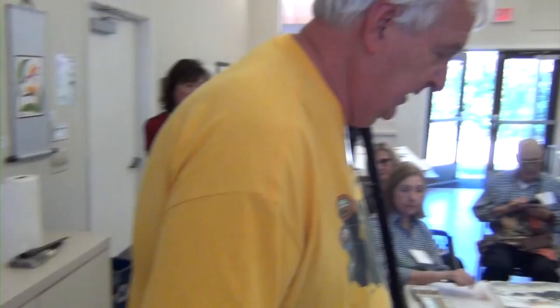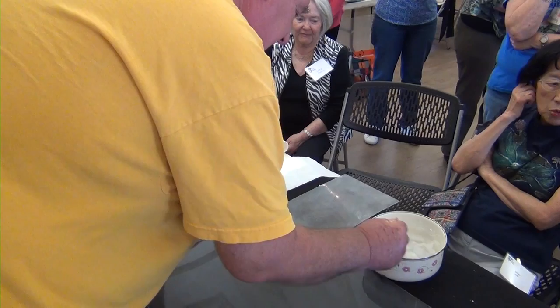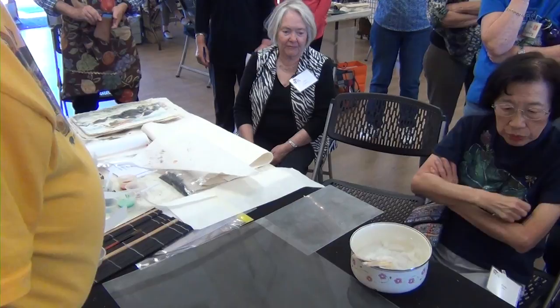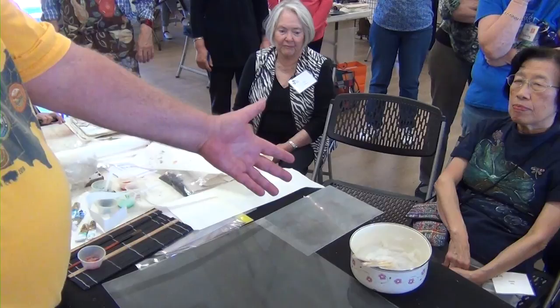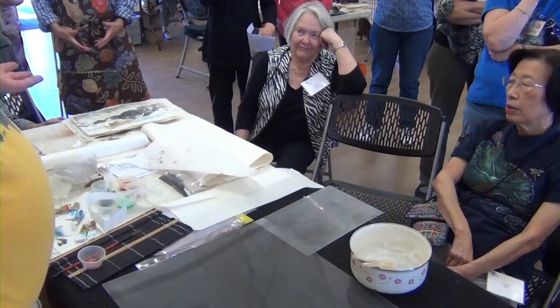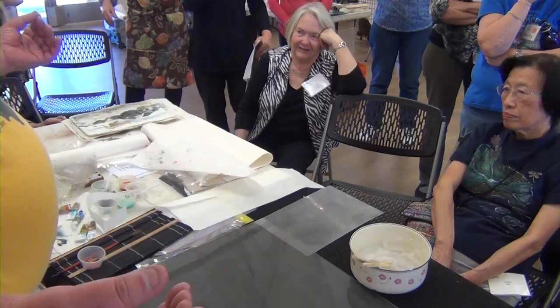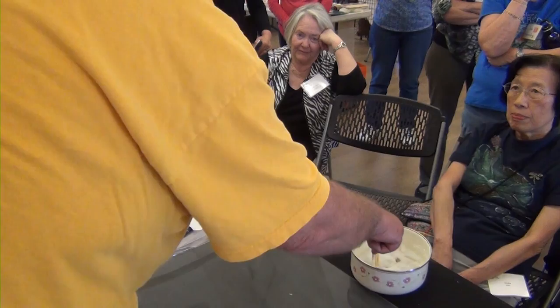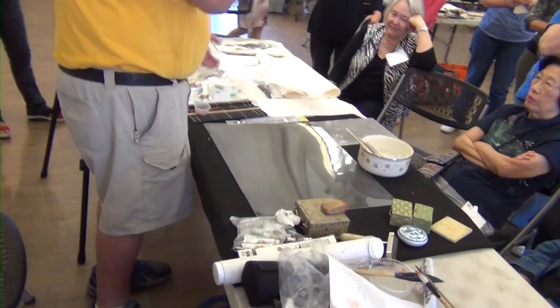The glue here — Henry has it made up. This is a little too thick for my taste; we need to thin it out. I use all-purpose white flour. It's amazing how many people today don't know what all-purpose white flour is — your mothers all know what it is. You can buy a two-pound bag in any store. Don't buy a five or ten pound, just two pounds. What I do is put it in with hot water and then use my immersion blender. You don't need to worry about lumps — the immersion blender turns it into froth almost, so the lumps are all gone.